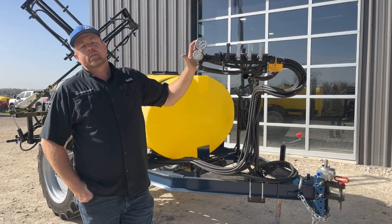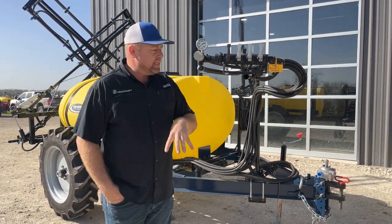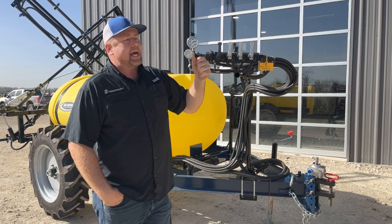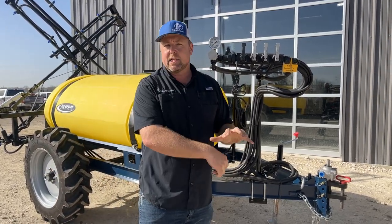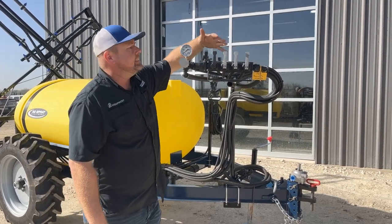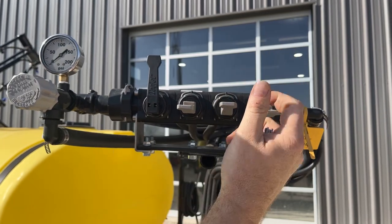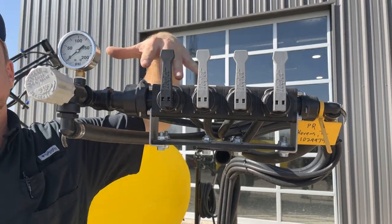Another exclusive feature at PR Equipment: we've worked with ag spray to add features we like from another brand we sell into the ag spray unit. We love the frame and a lot about this sprayer, but one thing that wasn't really our favorite was the valve system. Most ag spray units you've seen at your local store are going to have an aluminum AL-17 aluminum control valve with a single control lever — not our favorite, due to maintenance issues, longevity concerns, and threaded couplings. So we worked with ag spray to get these T-Jet modular control lever valves — independent lever valves installed on all the 500 and 300 gallon sprayers we sell here.